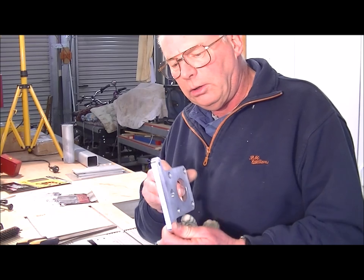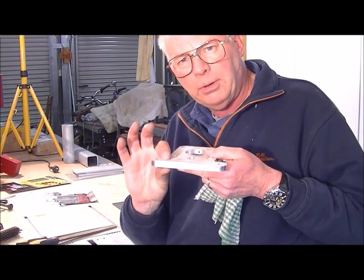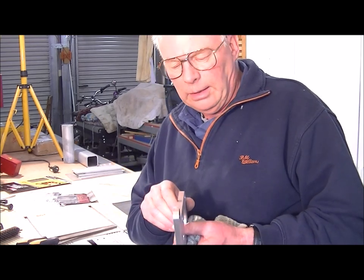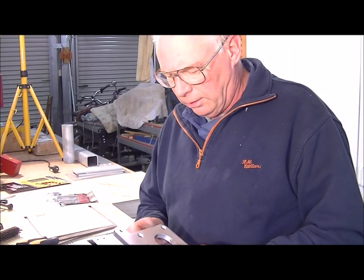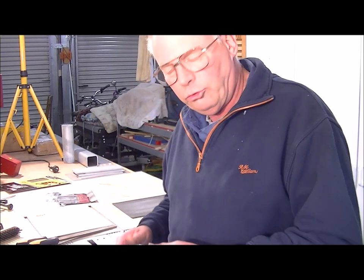This is a 9mm thick plate. What I'm going to do is take this base plate up to 12mm, and I'm going to drill a hole through here because it's left it a bit thin. Not everybody is really gentle with these machines, so I try to make it really robust and idiot proof.